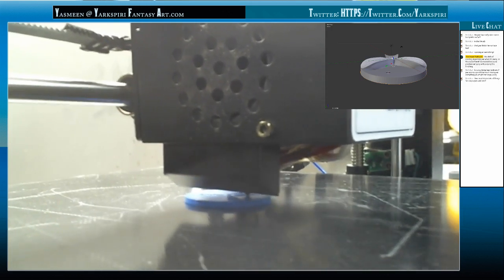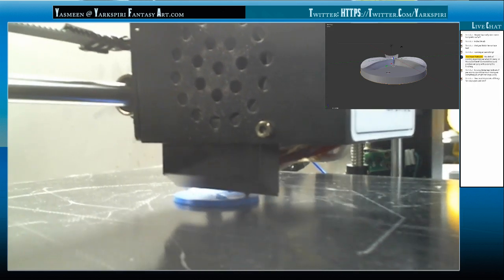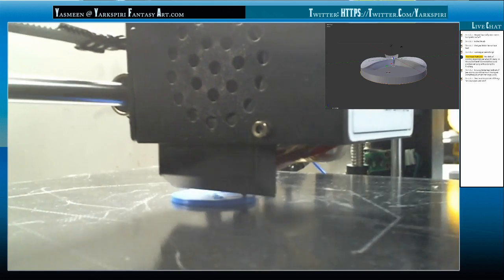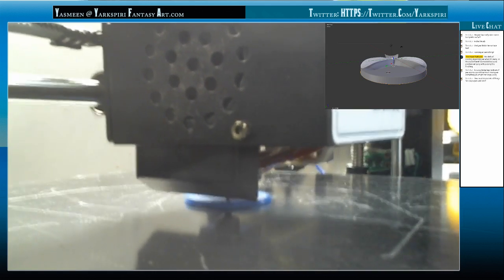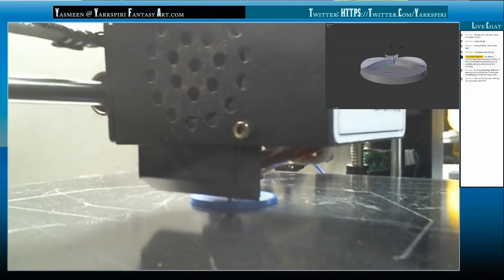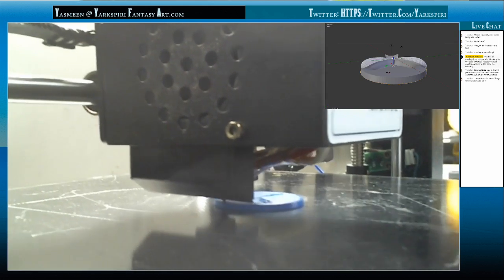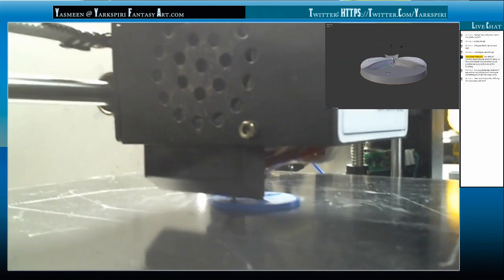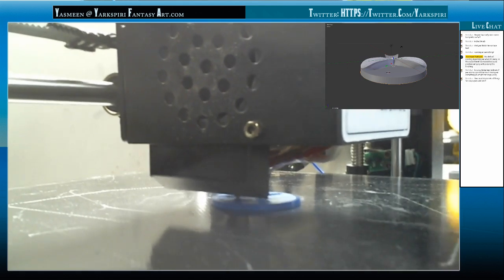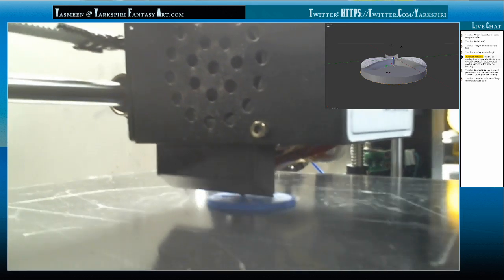If you know that you're finishing something too, you can actually get your prints done a lot faster with the really thick nozzles. So for my tape dispenser, I got the basic design off somebody else's design. The problem I had with it is it didn't have sink holes for screws or bolts, which I wanted, so I can actually secure it to my work table. And the design was not rugged enough, and it didn't accept my rolls of tape.